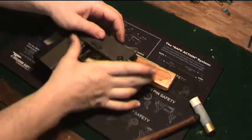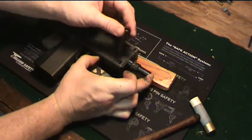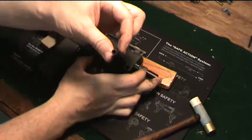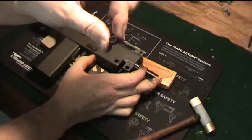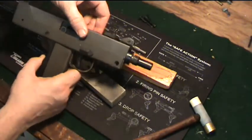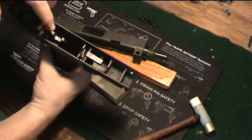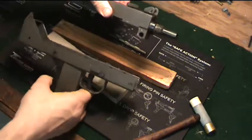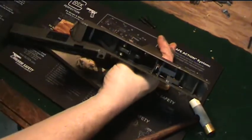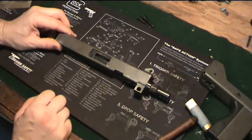Once you have the inner piece out, take the tension off the internal springs and pull that out. You'll see where it's under tension and where it's hollow. Set both of those aside. That spring tension will cause the upper to want to slide forward — just let it slide forward so it clears the hammer.